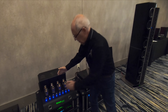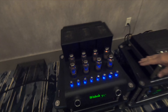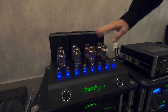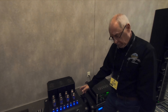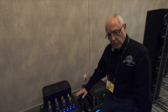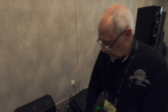If a tube shorted out or you shorted the speaker wires, the amplifier would shut down and these four tubes would turn red. If it was in the right channel, you'd check your wiring to your speaker in the right channel. If all that was okay, you'd know one of the tubes has gone bad. You'd start substituting one tube at a time, turning the unit off and back on. When it goes through the sequence correctly, the last tube you pulled out is the bad tube. We use 12AX7s and 12AT7s as small tubes and KT88s as the big tubes.